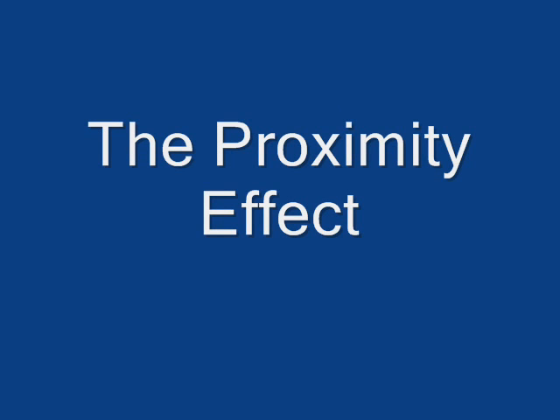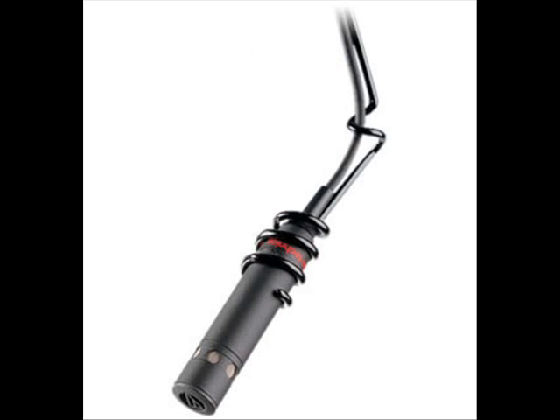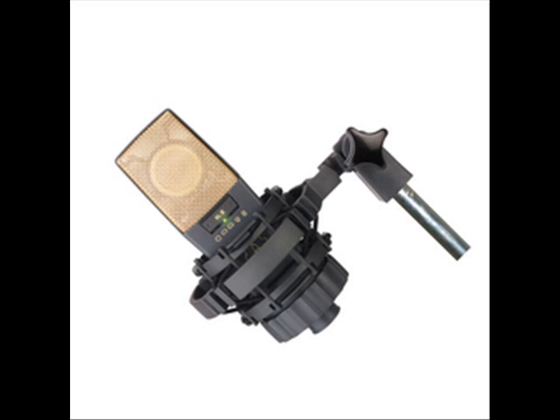Proximity Effect. Although you can change the mic's polar patterns, you have to keep in mind that when you get too close to the mic, there will be a raise in the low frequencies. You call this the proximity effect. It will also make your voice sound really bad. That's why you usually have to stand back a little so your voice sounds a bit clearer. Most artists like to sing close to their mic, so often there will be a proximity effect. To get rid of it, mics have something put into them called a low-cut filter. The filter basically takes out the low frequencies that cause the proximity effect.